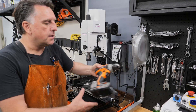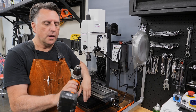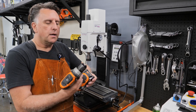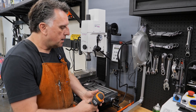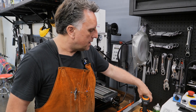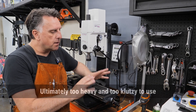A lot of people use these things to move their mill bed back and forth. It's good for doing it quickly. It's not that great for doing a controlled slow feed or anything like that. Usually you have to come up with some kind of a fork system that sticks out the chuck and you put the fork through the spokes on your wheel and away you go. It's heavy, it's fast, it's just not that controlled.